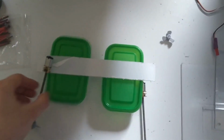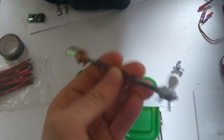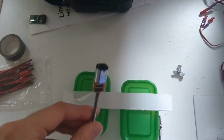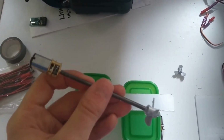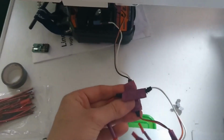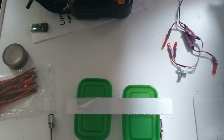on the end. These are N20 motors with a Lego propeller hot glued to the end. I went for the long shaft to keep the motor out of the water, hopefully. They're actually designed to run on 12 volts, so I can run this with standard Beetleweight parts. Here are some lovely Vex 29s from Crossbow. And that's kind of the plan.